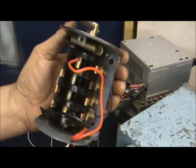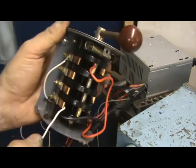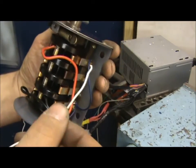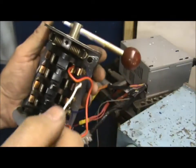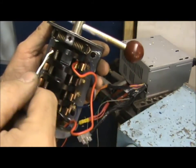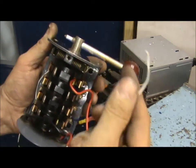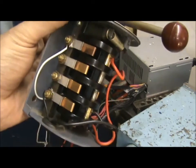Then, the wiring, the motors cross over each other as such, and you can see that one there, and it disappears and connects there, and vice versa. And effectively, when these 2 points hit, they power the motor. By crossing them over on this side, like so, effectively and quite simply, the motor will run the opposite direction, and that is it basically.